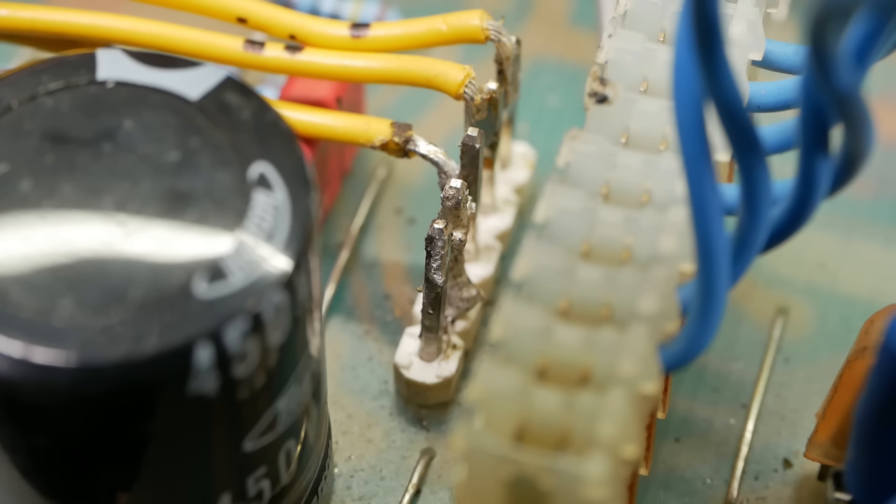There's a whole section of the board that's been drilled out — I think this used to have a heater balance trim pot on the actual board. It looks like it's been Dremeled out. There's been a heater-to-HT short and kablamo — this whole area is charred, so they chopped it out and ran wires, mounted a pot on the back panel with a central resistor and two lines to the heater to make a hum balance pot. In my opinion, all of that's unnecessary — just add two fusible half-watt resistors around 100 ohms to ground, slightly misbalanced, and you're golden. Not only that, but the pad has been lifted to make the resistor reach, and that's not reliable either.